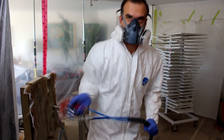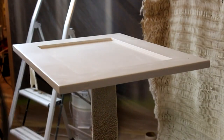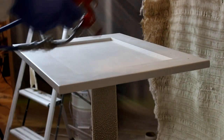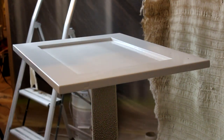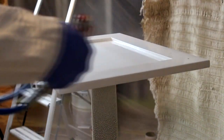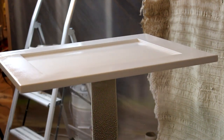Quick note here — obviously it's the final stage of the process. We're spraying the final coat. If you'd like to see the full process of cabinet refinishing, I'll link it somewhere around this video or leave it in the description down below. On this job, we're running an air-assisted airless machine, also called AirMix, which is basically pressurized material using airless technology, nicely atomized with a little bit of air supply to the gun at the same time. By using this system, we get both production value and an awesome finish.